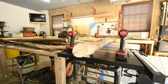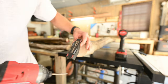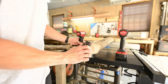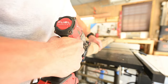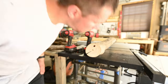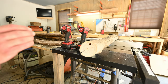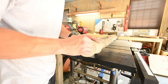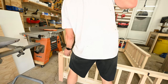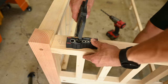After that, I connected all the limbs with dowels — just a slip fit so they could come together and come apart. To do this, I screwed a drill guide right to the bottom of each limb and drilled a half-inch hole for a half-inch dowel. Then I used one of the metal dowel point marker things, put it into the limb, placed the limb where I wanted it on the bed, and pushed down to create a little divot where I could then drill for the dowel.